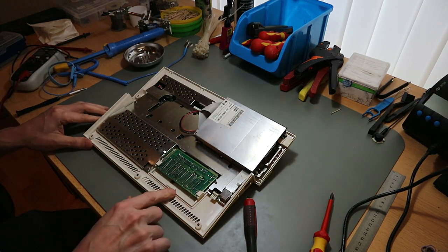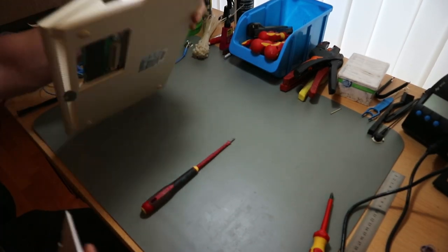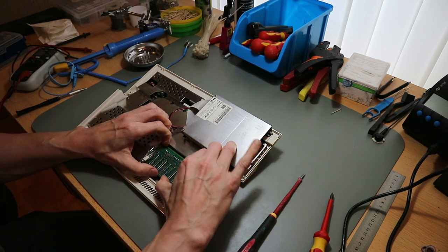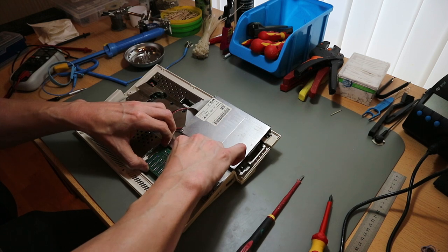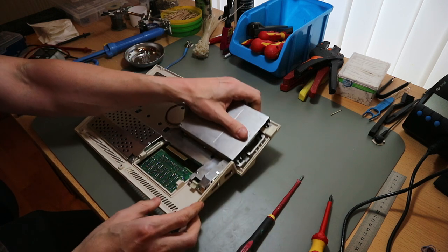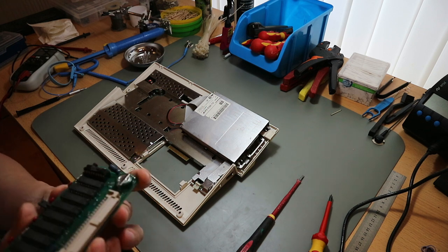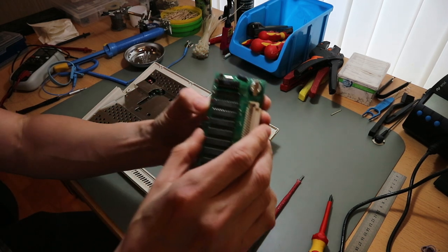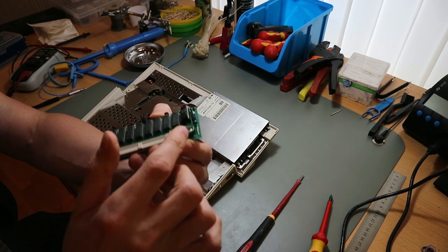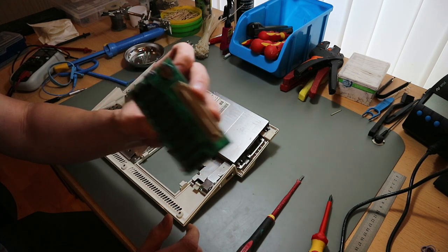And you see there's a RAM expansion installed. Trapdoor. Hoppala. So the trapdoor is out. So from this side you can get the RAM expansion out. It fits very tight. You can bring it out much easier from this side. So let's see. There is a little bit of capacitor fluid on this chip. And an old battery. This old battery we must get out. It's damaged, it can damage the whole board.